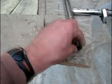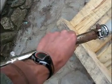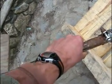If I put a weight through here I'll be able to put a weight far enough out and I can just balance it so that everything will be balanced and we won't have it flopping over to one side. I'll just have a wheel here and something to move it at 15 degrees per hour, and then we've got what we want to achieve — it following the sun. Hopefully I got it right that the focal point is right up here in line with the axis, at about camera level now. I think there's minor adjustment to be done, but fairly sure this should be okay. If the sun ever comes out again we'll be able to check it.